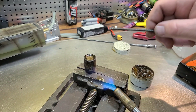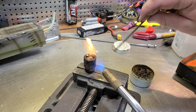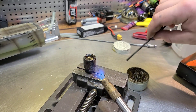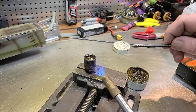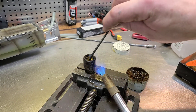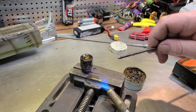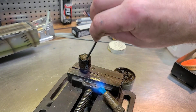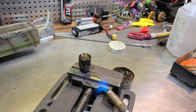You can sand it. Heating up my solder that's in my crucible. Put some flux on your cable before you dip it. I don't like to get my solder really hot — it's best right after it starts to melt. Dip it in your crucible, wipe it, flux it, dip it, wipe it, flux it, dip it.